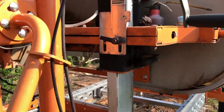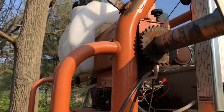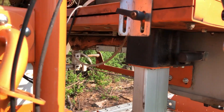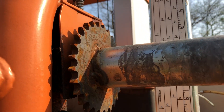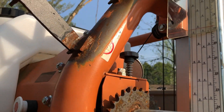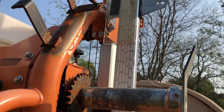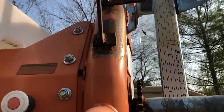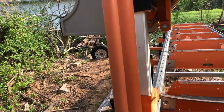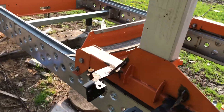For lifting and lowering, there's a crank right here that raises and lowers the head. I welded a sprocket onto there. There's a cable brake on the inside that's adjustable. That's my motor mount — I'm redoing it because I hate it. That's where the motor for raising and lowering is going to go. For measuring position, I'm going to use an encoder on the back of the motor — I've already got one mocked up.